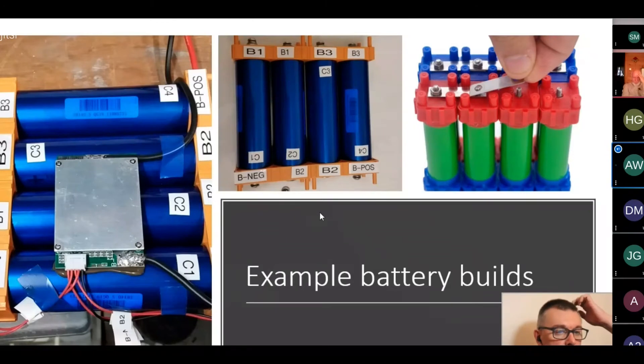These pictures show some of my battery builds. On the left is my original 12 amp-hour pack in its state of assembly — four 38140 cells in a flat four configuration with end caps and bus bars across the ends. The middle picture shows the individual cells and the labeling I use. At the end there's another shot of a battery pack being built using the connector blocks and 18650 cells.